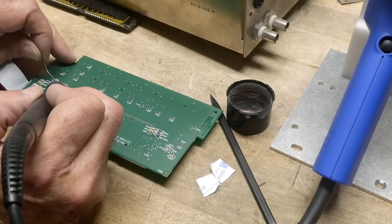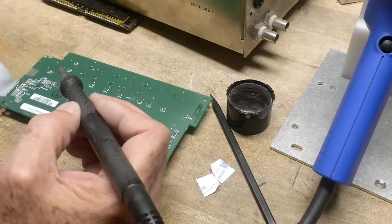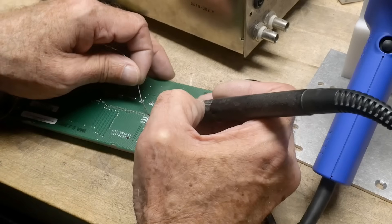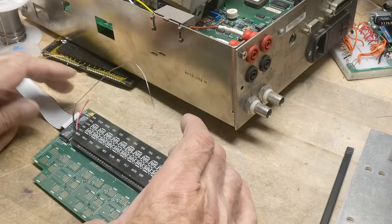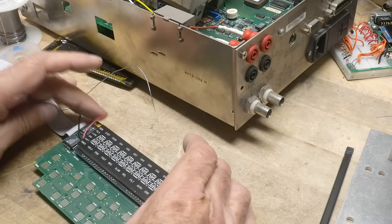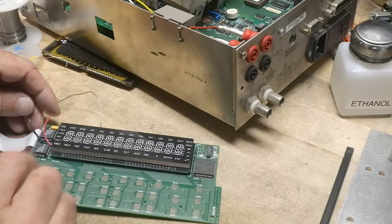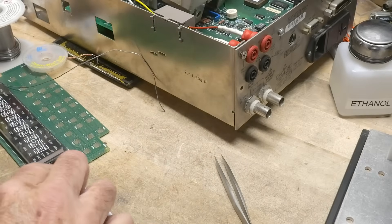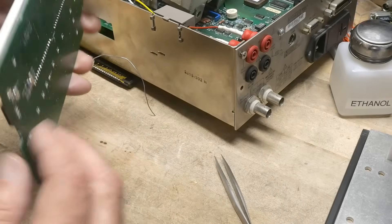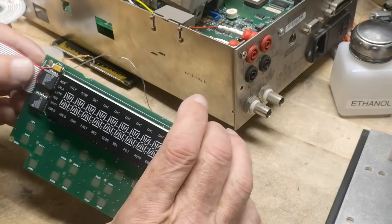Got the shakes this morning — don't know why. Boys had shaky hands and some days are worse. No, I don't drink. Now we need to connect these two wires to that capacitor right there. Plus goes on that side and minus goes on that side. So that's all you have to do — put the red wire on that side and the black wire on that side.